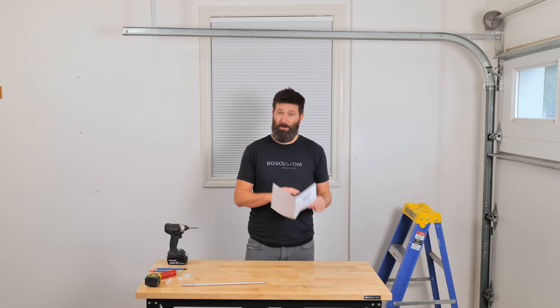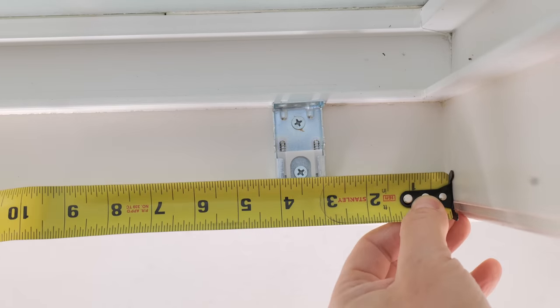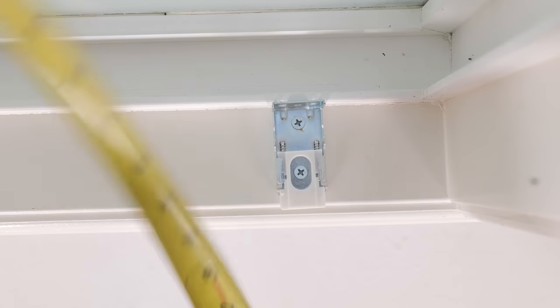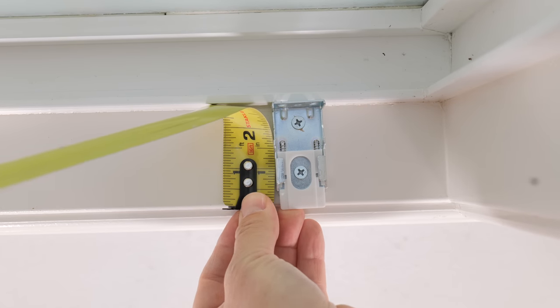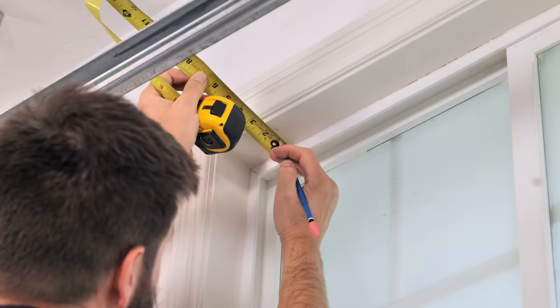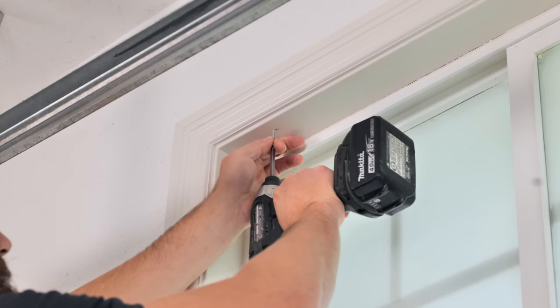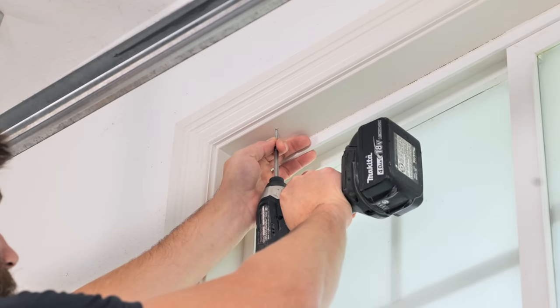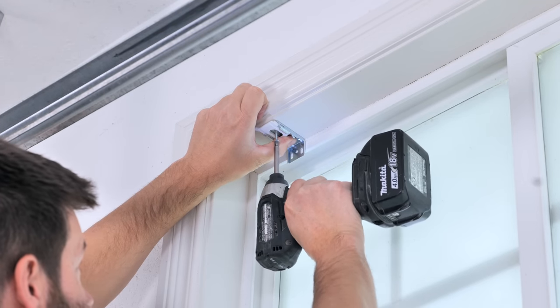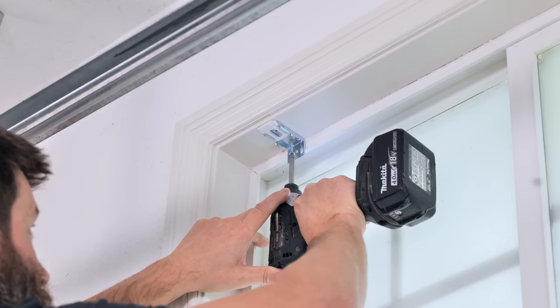The installation manual is not super clear and a little hard to follow, so let me walk you through it. You want to mount both brackets three and a half inches in from the end of the blind — that avoids the winding mechanism. Then mark the lead screw on the bracket 15/16 of an inch back from the front of the window for a flush installation. A handy tip: before placing the bracket, put one screw into the marked location halfway, pull it out, then pop the bracket in — it's easier to screw into that pre-drilled hole.